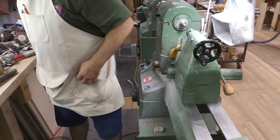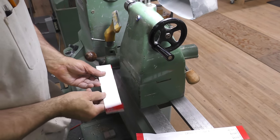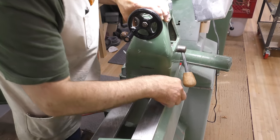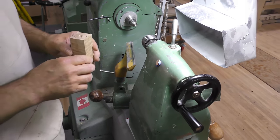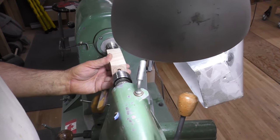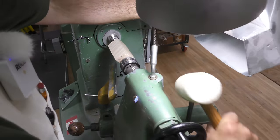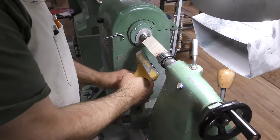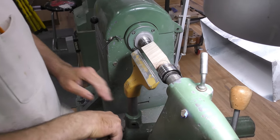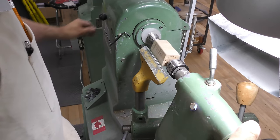You may find this — I don't know why they don't make wood turning lathes a little more accurate, but I need these two shims in order to line those two points up closer than they would otherwise. And this was an expensive lathe. I'll turn this way — this would be the small end out here. Lock that in place. I may have to tighten it up a little bit more. I want my tool rest to obviously clear the piece of wood, and I want to be just a little bit below half. Make sure that's good and firm. I'm going to turn this up. Now I'm going to use a skew chisel and it should be sharp enough.